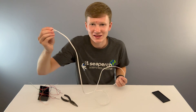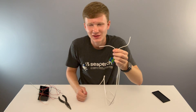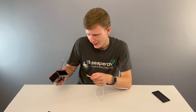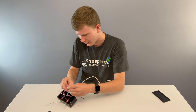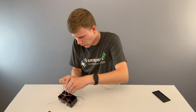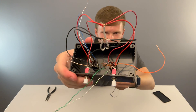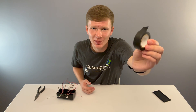Now get your 18-gauge 2-core wire. Split it apart about 4 inches on one end and 6 on the other, and strip about half an inch of insulation off of all the ends. Decide which core will be positive and which will be negative. Take the exposed wire and pull it apart about half and half, then put this wire up through the bottom hole in your controller. Twist two of your red positive wires with one of the halves of the 18-gauge wire that you decided would be positive. Get your other two red positive wires and twist them with the other half and twist it all together to make one big wire bunch. Do the same with your black negative wires. Note: you're not soldering any of your colored wires here. When done, you should have a big hub for your red and black wires. Now solder it all together — this will require a lot more solder than your other connections. Make sure there's solder covering all of the wires. Your connections don't have to be pretty, they just have to work. Once cooled, wrap them in electrical tape.